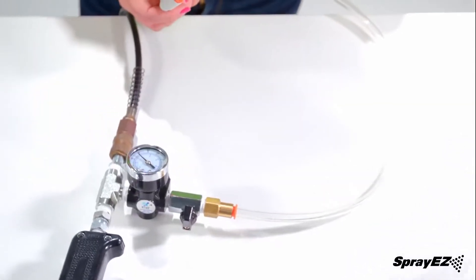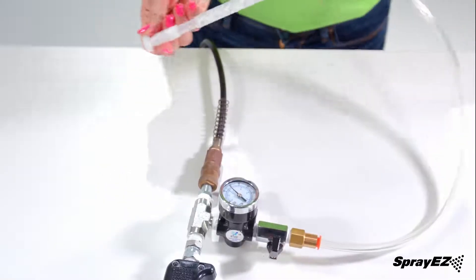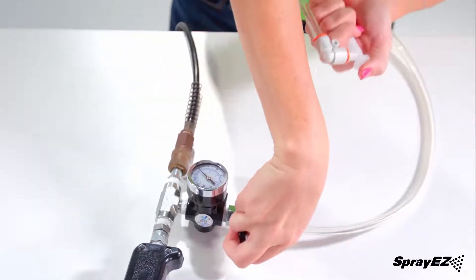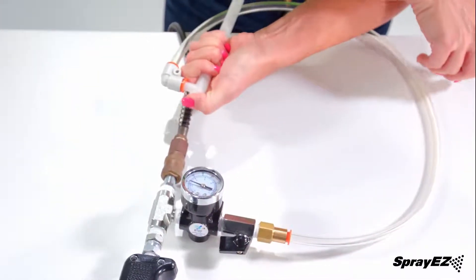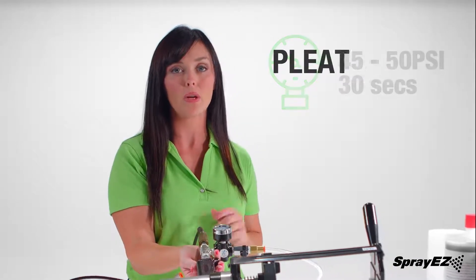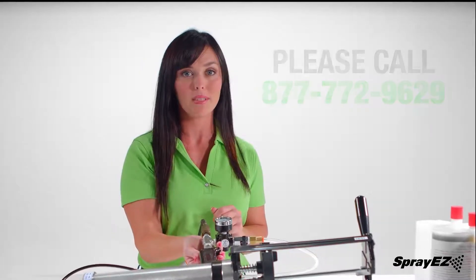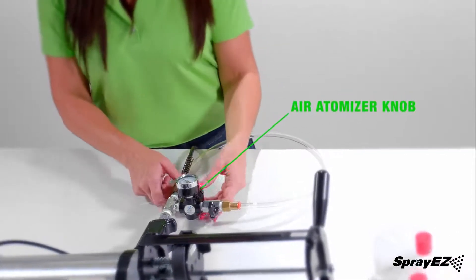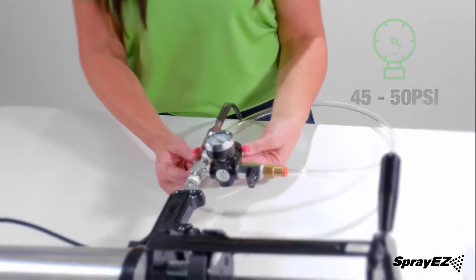To set the proper pressure of the air atomization, take the static mixer and put it in the air atomizer, then put your thumb on the end of the air atomizer and turn the valve. When you turn on the valve, the pressure should be between 45 to 50 psi for at least 30 seconds. If not, chances are your compressor is too small or there is another problem — please call us immediately. You always want 100 psi going into the gun. To adjust the air atomizer pressure, pull the knob and rotate it until you get 45 to 50 psi.